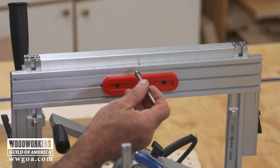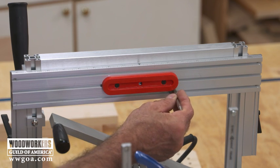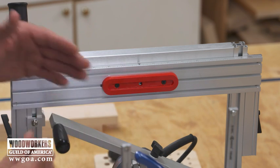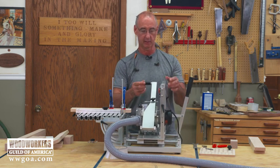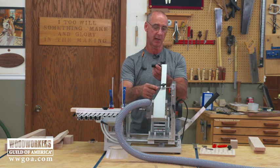This is a pantograph. There's about a 2-to-1 difference from the following that I'm doing here, what the stylus sees, to the cut that's being made over here. And that's why this looks so long relative to the resulting work. So, a lot of talking. Here's the action. Follow the instructions in the chart.